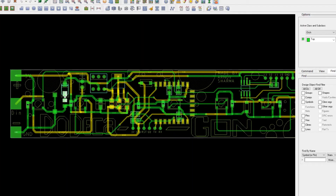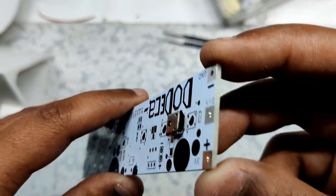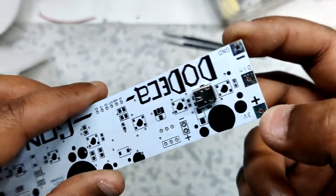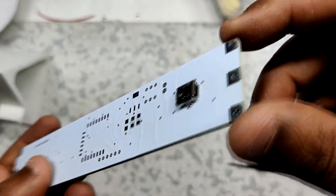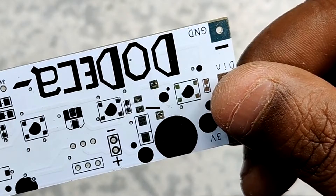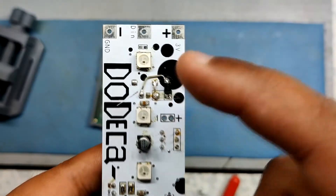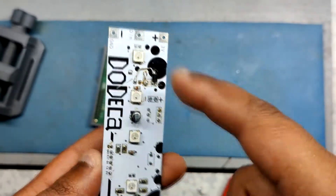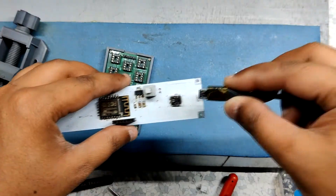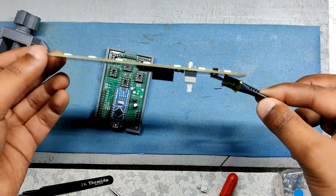In the PCB design I made a mistake — the micro USB pads are currently on the top layer of this PCB but they needed to be on the bottom side. Because of this mistake, when I place the USB on the bottom side, its polarity inverts and positive becomes negative and negative becomes positive. To correct this error, I just cut both tracks and soldered a wire in the correct arrangement. We only have to do this change in a single PCB, as this is only for supplying power to the main board.